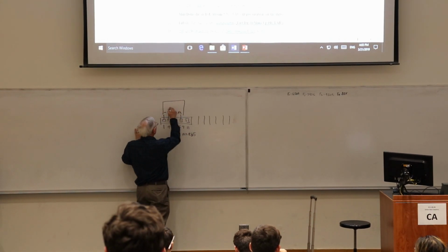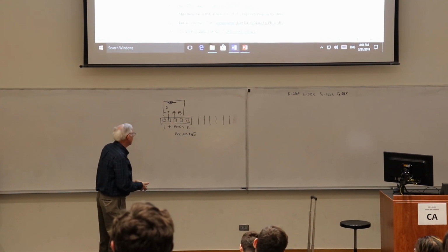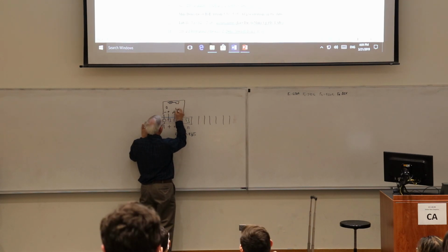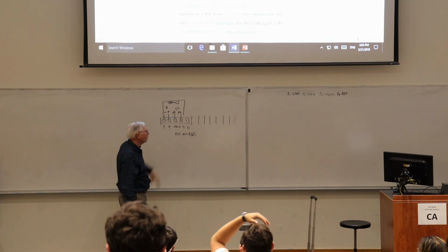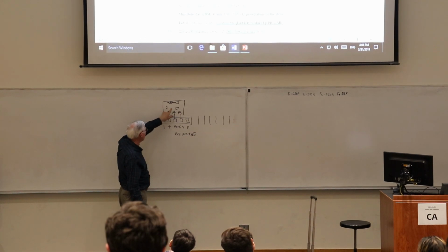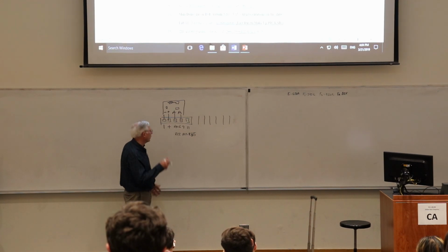One of them has the little temperature sensor plugged into it, and then the other one has a little photoresistor. We'll talk about the photoresistor in a minute. There's also a resistor here, and there's a cap across the power and ground. So there's 2 little parts: the temperature sensor, which looks like a little transistor, and then the photoresistor, which doesn't look like anything except the photoresistor. I'll show you a picture of that in a second.